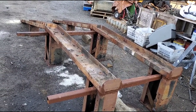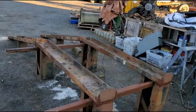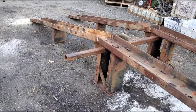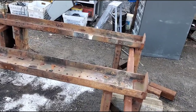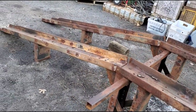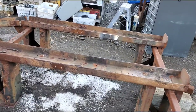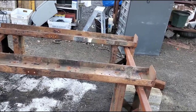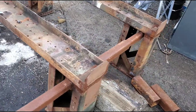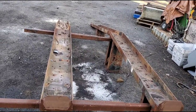That is the most awesome set of car ramps you've probably ever seen. They're made to hold that 8,000-pound forklift sitting over there. Working on this thing, and any heavy equipment machinery — especially forklifts — it's downright dangerous to have this thing jacked up on jacks. It is such a wonky machine, it's hard to jack up, and it's not really meant for floor jacks and such. So I built this handy ramp.